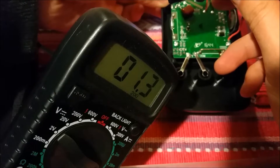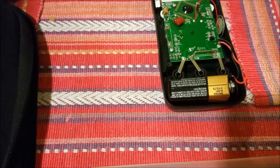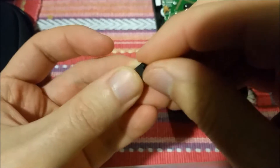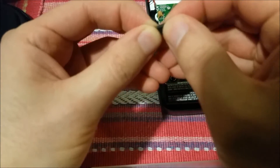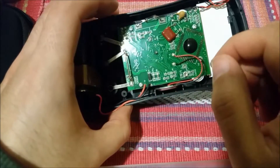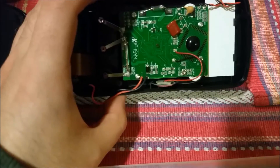I don't keep my meters on all the time, and I'll make this so that you can shut it off yourself anyway. That's an acceptable modification. So what I'm going to do is modify one of these meters with a little jumper that can go into the battery bay so that if it's on, it'll permanently short the button closed so that it'll always be on the backlight. All you have to do when you want to disable it is just move the jumper to the side and it'll act like normal. I'm going to trace out where the wires go and solder some wires there, and I'll show you after I'm done and show you it in operation after the modification has been done.